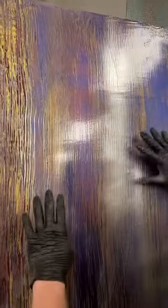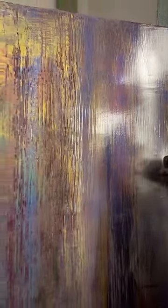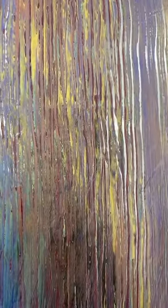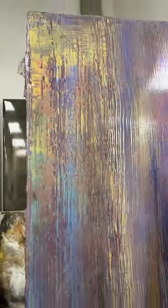So I troweled wall epoxy on there, and I had a color in the base that was this red burgundy color, and then I just kept spraying all our accents on top. So now as I sand through it, it's exposing all those different layers and striations, and it gives you the kind of wood grain. It never looks nice on top, but after you sand through it all, it really gives you the differentiation.